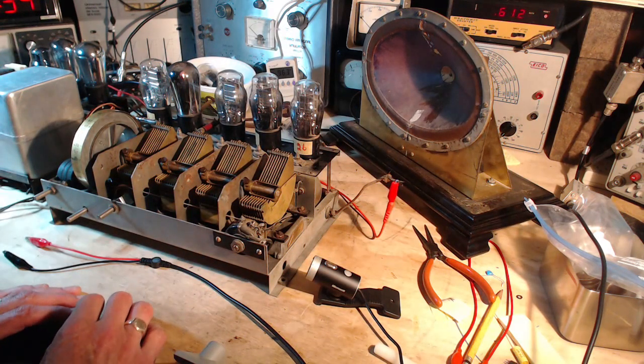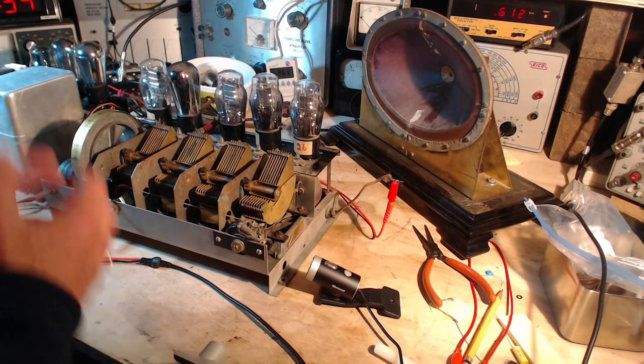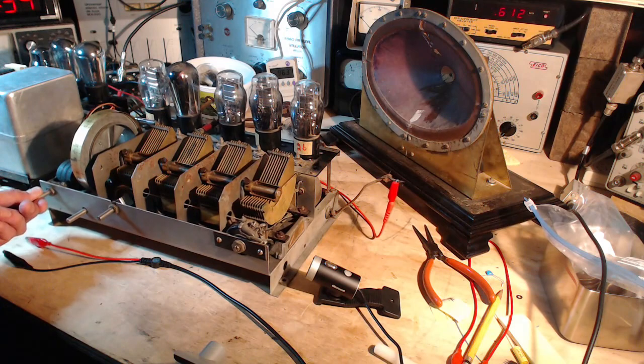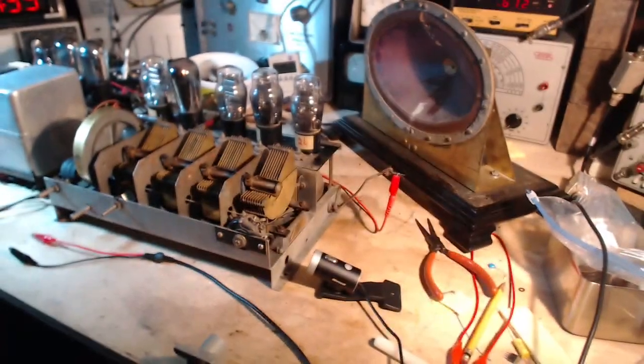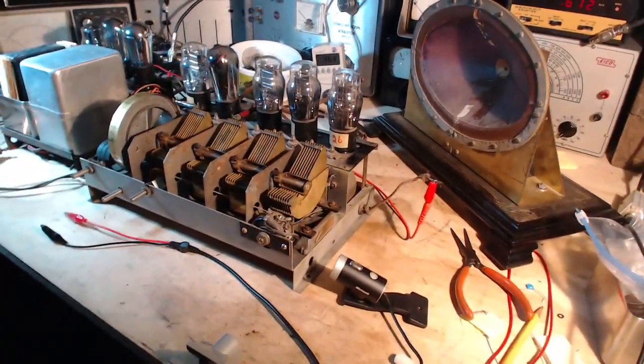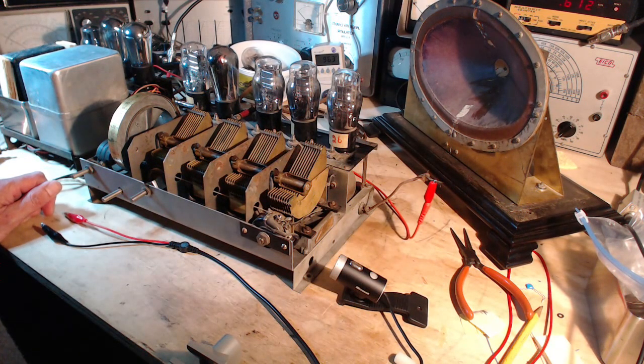Frankly, not sure. I really never saw these before, and if I have, I didn't know what they were and I ignored them. So, the next step in making this radio work better, I don't think it's this. I don't think this is going to help us make it work much better. This essentially is some kind of tuning deal with the antenna, I believe. Sometimes these gizmos are related to the feedback, neutralization type scheme in these radios. I don't think this one is, though. It seems it's right on the antenna line, but we'll have to check.